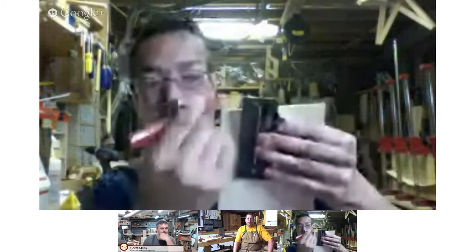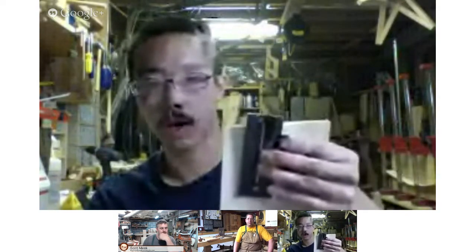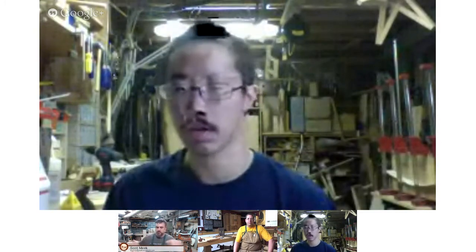And I'll saw down until my back saw bottoms out or close to there. And I try to make them as straight following the lines as possible. And then once I get used to being able to follow the line exactly straight, I'll try and put them closer and closer together. By creating a really fine finger between the two, you're really forcing yourself to be absolutely straight, because if you wander off that line, you're going to take off the finger next to it.